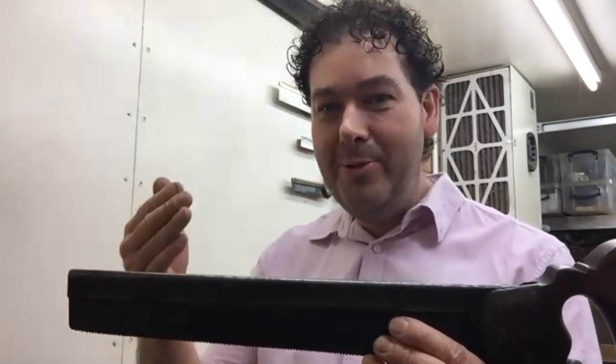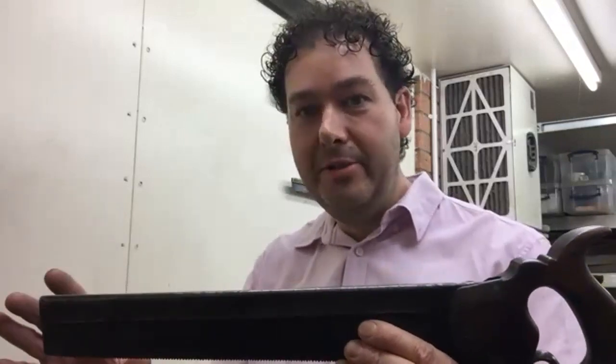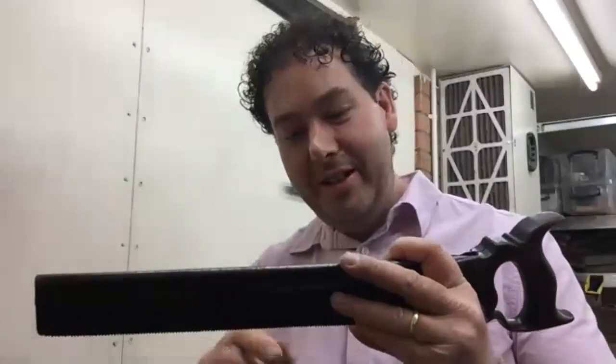So when you go to 100 years ago, the saws were actually pretty poor. We had all these makes all competing, but using the worst materials imaginable, just because they could make more profit, make more saws, make more money. So this conception of thinking, oh, I've got this old saw, I've got this old Tyzack, thinking you've got the world, really you haven't, because the steel over time actually ages itself. It's not a case of it being moved or manipulated and work hardening. Carbon steels actually inherently get brittler and brittler and brittler over time.